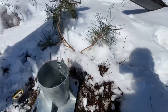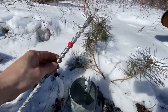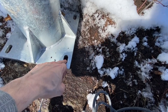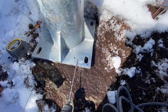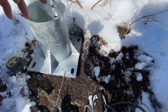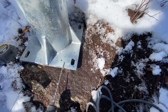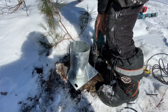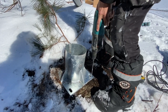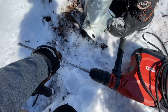One of the tricks you can do to ensure that your larger bit doesn't drift when you get started is to use a quarter-inch or three-sixteenths bit to get your center point first. That way your larger bit won't drift on you. We're going to go ahead and drill the first pilot, get things lined up, and then drill the rest of our pilots once we have our first anchor in.